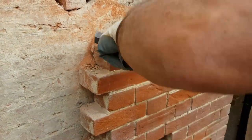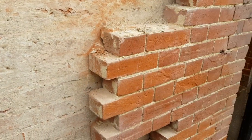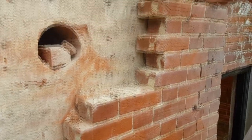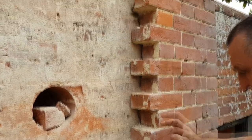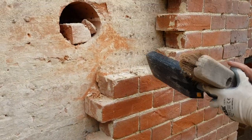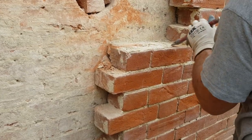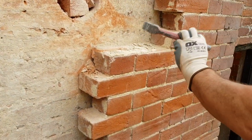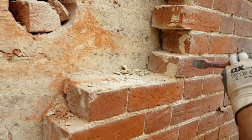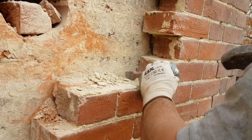I've got to take out these bricks here. We'll take that brick out — this is called tooth and in, so when we rebuild the wall, it's already toothed out. What we'll do is brush all the rubbish out so it doesn't go in our eyes. I've just got to clean this piece up using my comb chisel. The biggest job I've got to do is make sure I don't break that brick — I don't want that one to bust off. I've got to get this out.